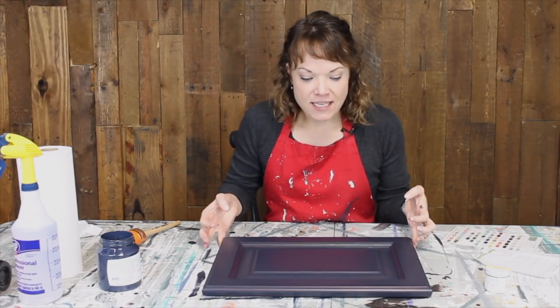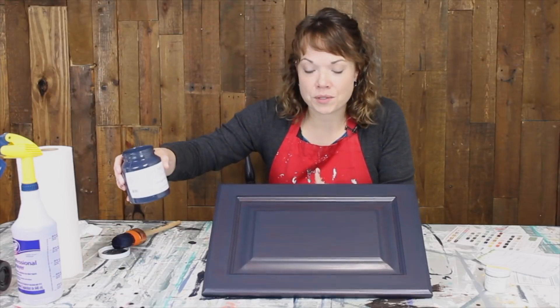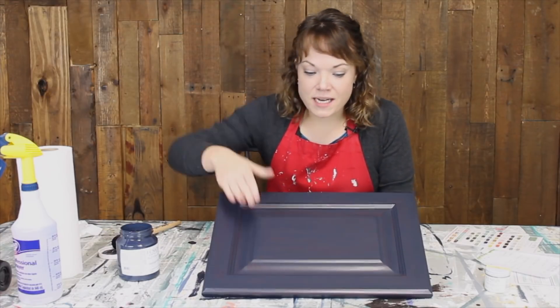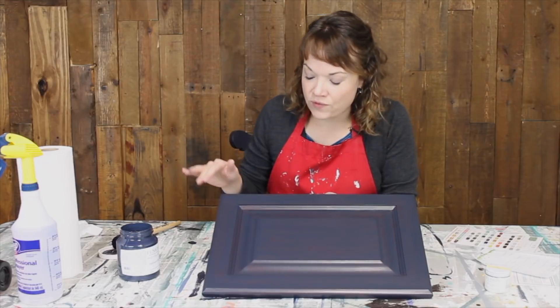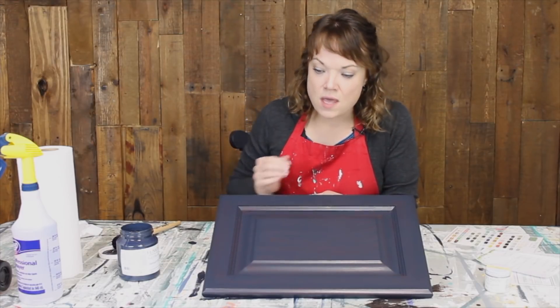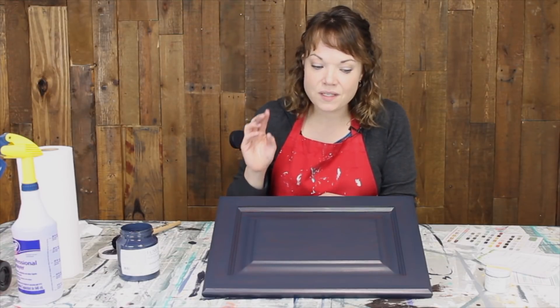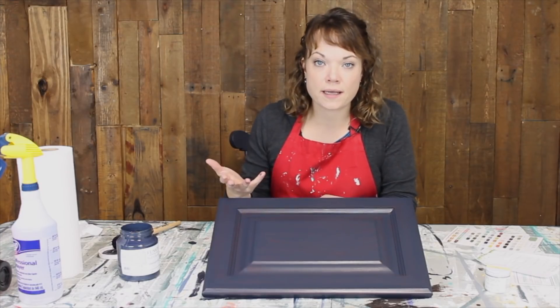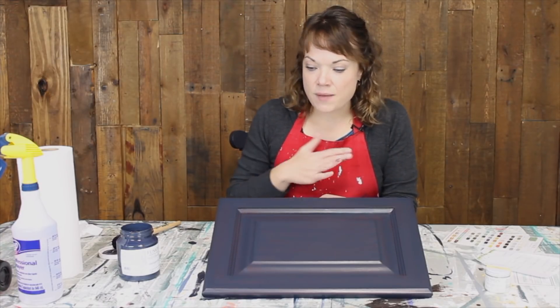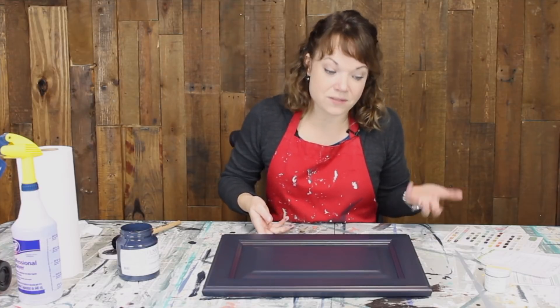The door is dry, so let's take a look at it. It would definitely need another coat to get full coverage — you can see there's wood coming through kind of all over. It looks really cool though; it's actually a really neat finish. The color is gorgeous — this is midnight blue — and it turned out really smooth with just a little bit of built-in sheen. So I think with one more coat it would cover really nicely. It does say to let it dry for two hours before adding another coat, but it is all water-based, so it's easy to clean the brush and clean up, and it dries pretty quickly.